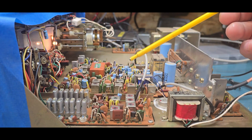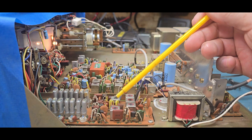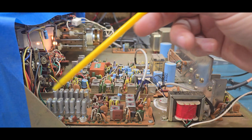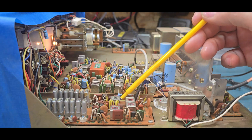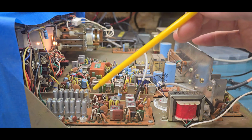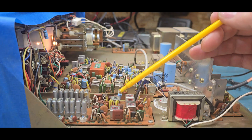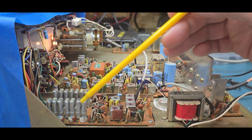You've got a crystal-controlled radio and you want to know where to inject clock zero from your DDS signal generator. Let's review real quick how this works. This is indicative of any other kind of crystal-controlled CB radio — they're all going to be basically the same. The mixers may be a little different, or maybe little changes in the circuitry, but basically they're all going to have a channel selector here going down to a bank of crystals.